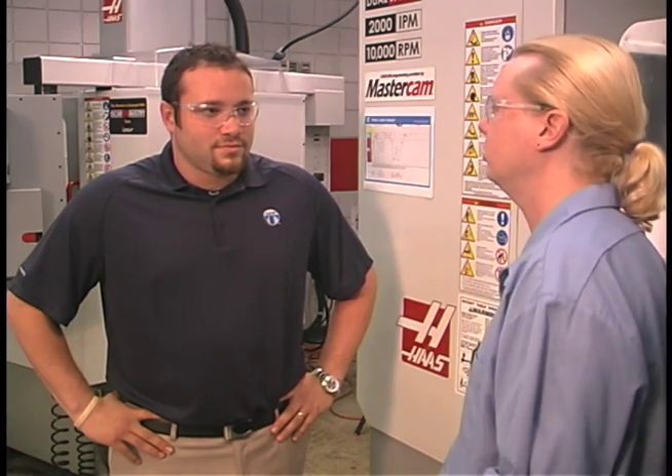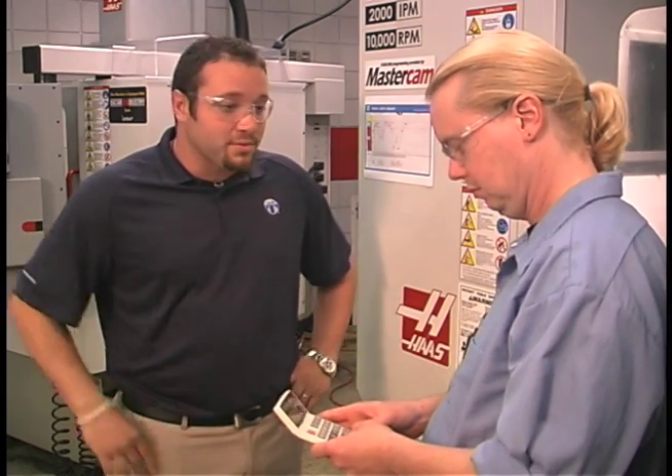So should I multiply my percent Brix by the 1.22 to get the actual sump concentration? That's right. If the unit displays 12% Brix, your actual sump concentration is 14.6%. Wow, that's way high. I guess that explains all the foam. And low concentration can actually lead to shortened tool life, rust, and bacterial problems.